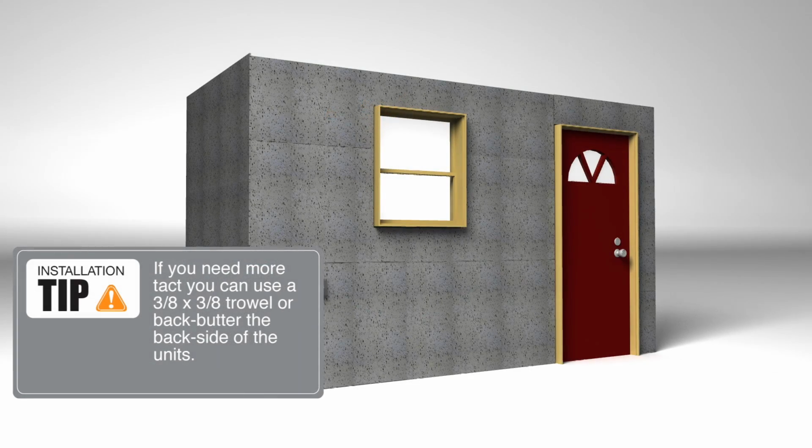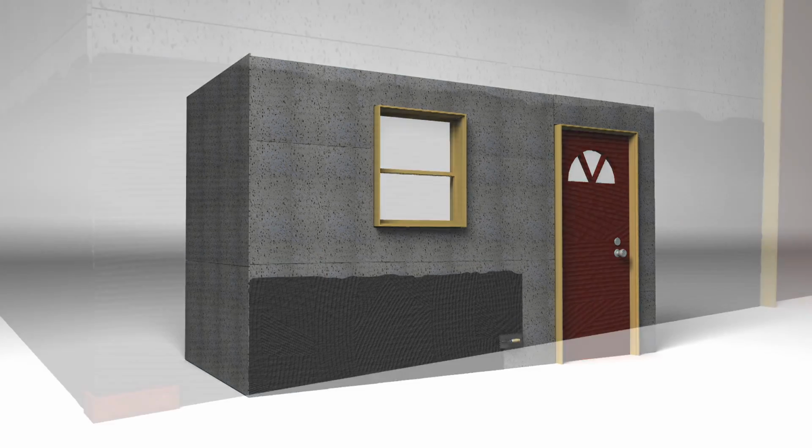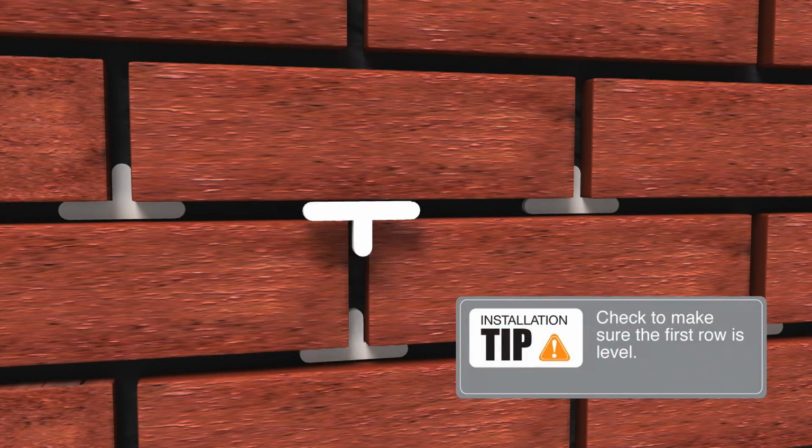With the notched trowel, put a layer of Laticrete thin brick mortar on the wall. Maintain a vertical orientation of the pattern to also facilitate any water moving down. Now apply your thin brick to the wall, pressing down on each unit. Continue using tile spacers to maintain pattern.